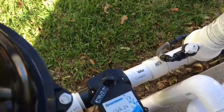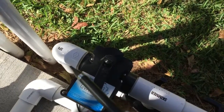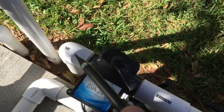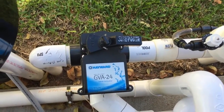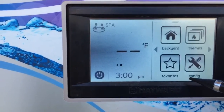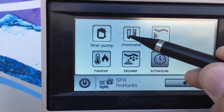When you turn off the spa pump, it's going to reverse the valves again — you can see the valves changing automatically. We're turning off everything spa-side. The closed position is going to be facing whichever area is going to be off or closed. The valves are turning back around so we're no longer pulling water from the spa. We're back into pool mode, which is going to allow the system to kick back on to circulate the large body of water.